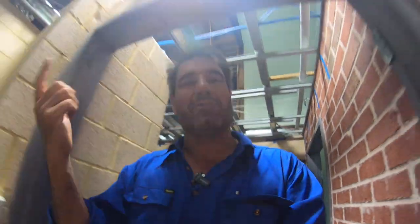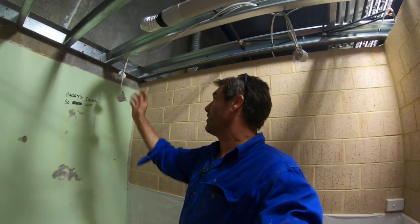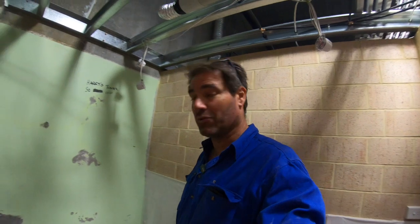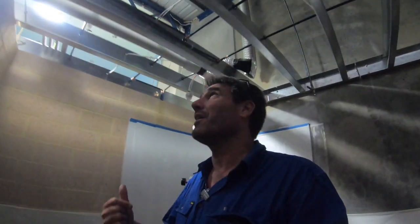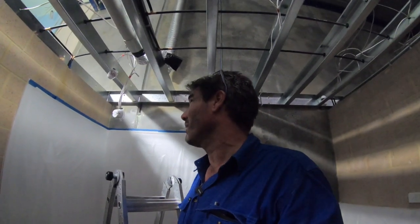I've got a fan because the bathrooms have to have an exhaust fan. So I've got an exhaust fan for this bathroom and it's also got an LED light in it as well — that's for the ambulant toilet. I bought two of the same, but Pete being Pete, he checked his regulations. In the disabled bathroom you have to have a rating of IP4, which is a better rating, so I've had to go and find a fan with that IP4 rating so you can have it over the shower.